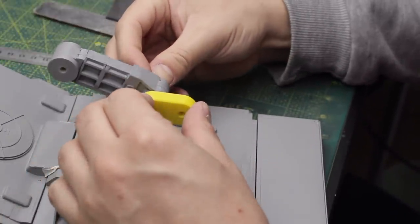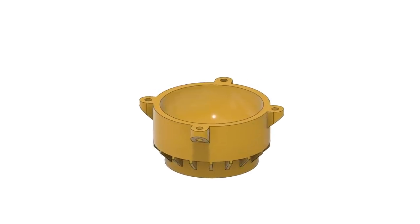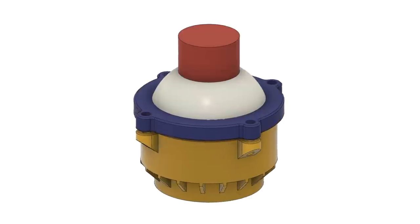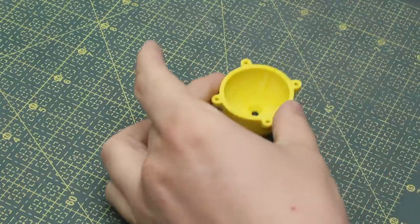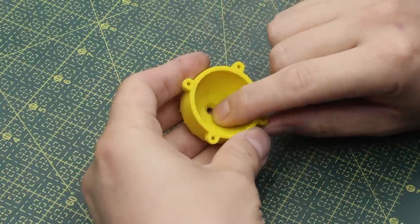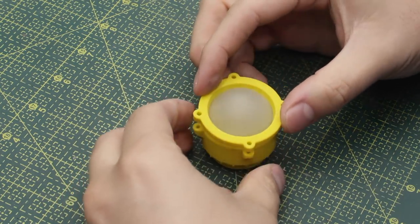Now I need to go back to the ball joint. Now that I really understand how a ball joint works, I went back to the drawing board and came up with this design. There's a socket, the ball goes right in the middle, and on top goes the pressure ring — shown in blue in the video. On the body of the socket and on the pressure ring there are 4 holes where I'll put some bolts to add pressure to the system. I've just printed those pieces, and there's also a hole in the socket so I can put a bolt through it, going through the intermediate leg piece, and then I just have to assemble everything together.